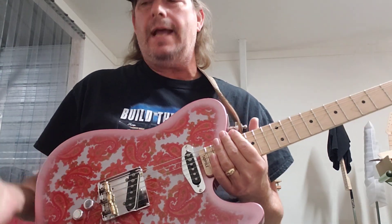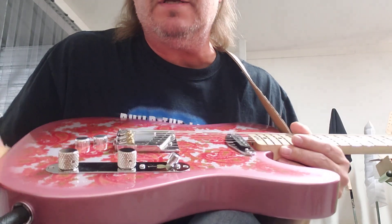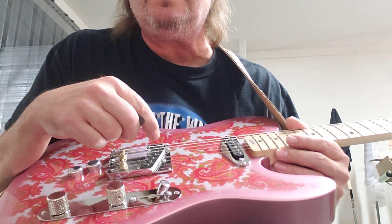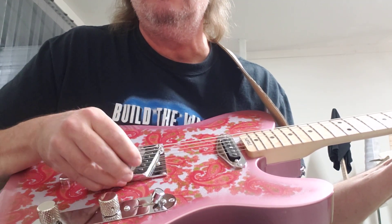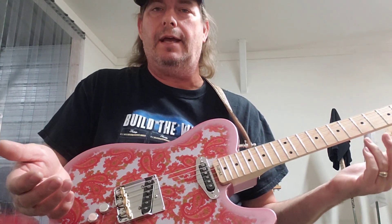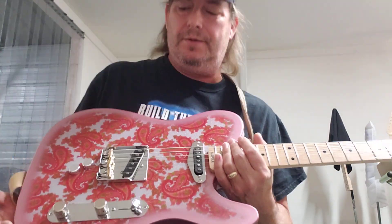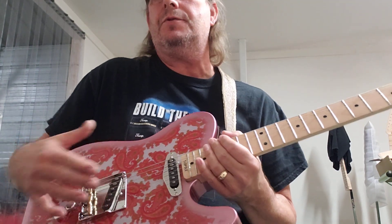It's kind of subtle but it's actually changing it quite a bit, and it's all passive — that's the beauty of it. The pickups are wound to six-and-a-half K, then we tap them and add another 2K of windings around the original wind, which makes it about eight-and-a-half K.